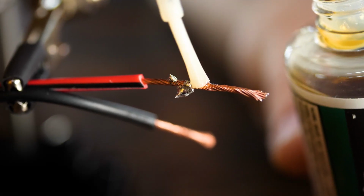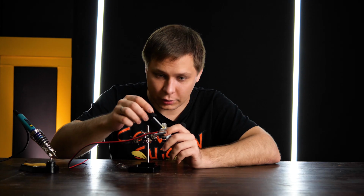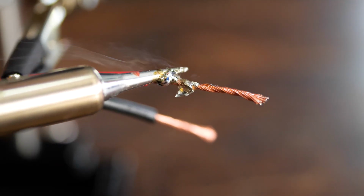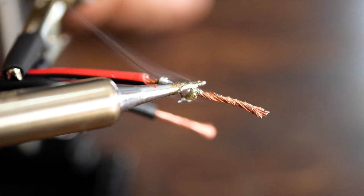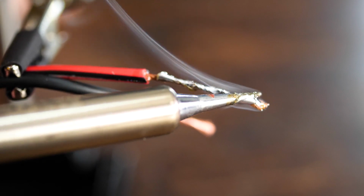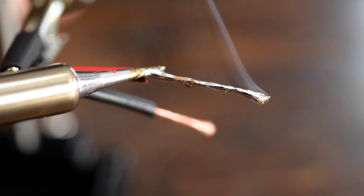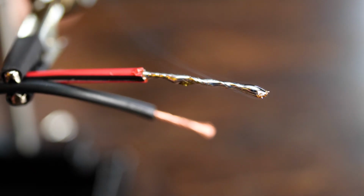Since the soldering iron is very hot, the part also heats during the process. The copper in the wire reacts to the oxygen in the air and oxidizes, and then what is called an oxide film begins to cover the surface of the wire. Flux melts the oxide film and prevents it from forming again during soldering. Specifically, this wire gets as if saturated with tin. So Flux is something that lets you easily tin plate wires and other parts.